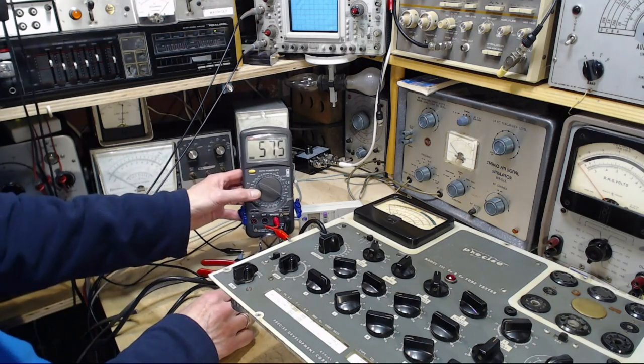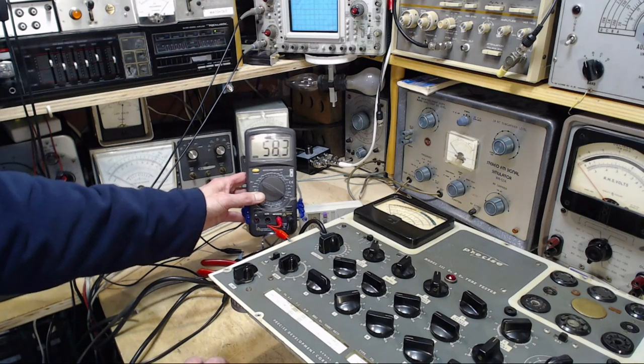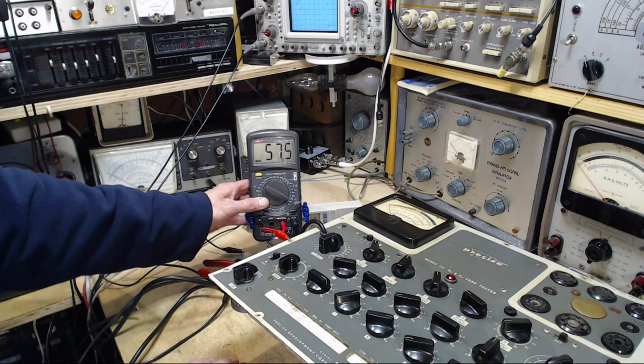And the other end of this. Right, because I don't have the ground pin in. Well, now it's doing the nice half of 120. Didn't do that before. That's okay though. That's the kind of voltage you expect to see on the case of something that is picking up its charge through some high impedance thing like a capacitor or something like that.